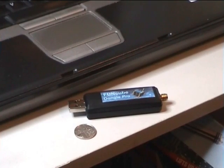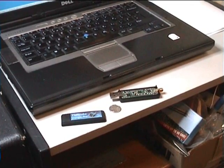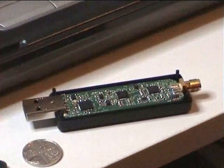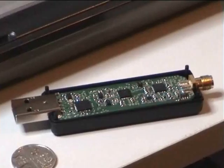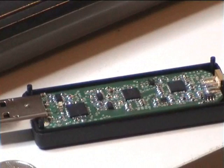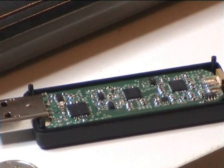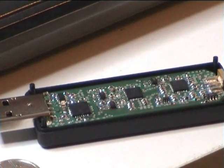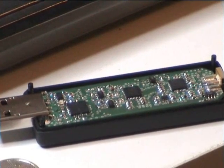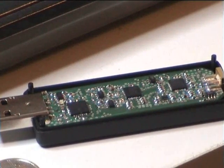I'm just going to show you what's inside it. I've taken the top off, and you'll see here the electronics inside it. On the left there is a microcontroller — it's a PIC. I've actually managed to get the code from originally a PIC32 down to a PIC24F device. You'll also notice that rather than using QFPs, I've pretty much gone to the QFN leadless packages. This is largely just so you can fit it inside the small USB dongle case.